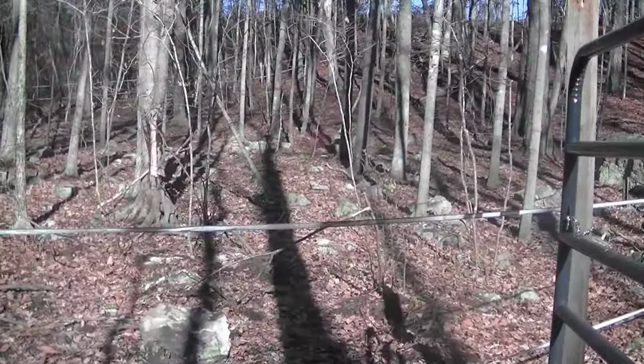You want to hold it down on a nice flat surface, really hold your straight edge down nice and tight. And I'm just going to take my blade, and usually about three times is enough. I'm just going to run it right along that edge. Make sure you really hold tight because you don't want it to move while you're doing this. Just about three times. Just like that. Remove your straight edge.